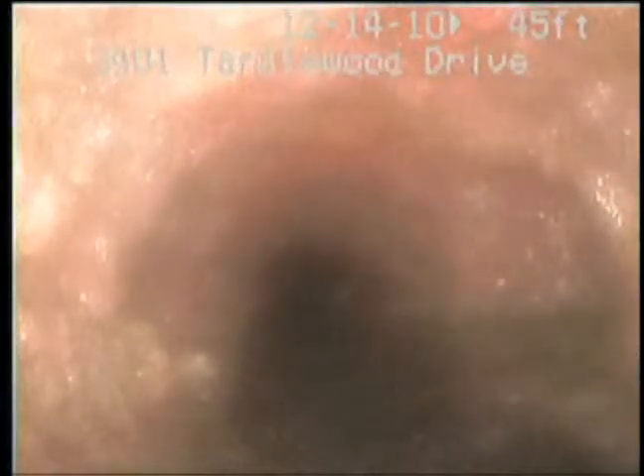See how it just got restricted right there? You've got two openings — one on the left and one on the right — that's probably back-to-back bathrooms. It's a cross fitting — goes straight across, so it goes down that stack instead of down the line. It was going across and coming up the other side. It's a common problem; they should stagger those instead of running cross tees like that.